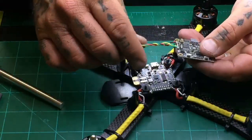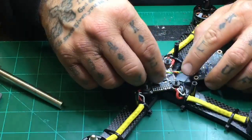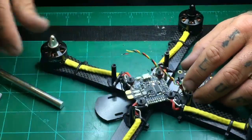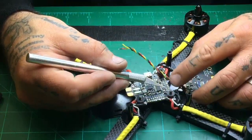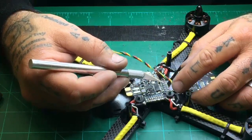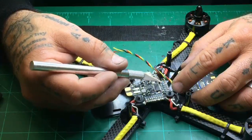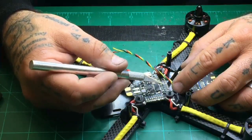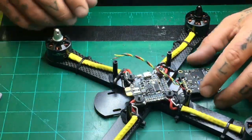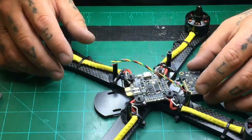Okay, so on the VTX, the idea here is to lay the board upside down and see how far we want to go with these wires. I like to keep them pretty thin, and I want them to run underneath. So the board's labeled pretty good here. It is set for 9 volt. I tested this with my voltmeter and my multimeter, and I did get higher than 9 out of these. But I'm sorry, it's up here. This is just the solder to tell the board which one. You can either just move it to 5 volt, or you keep it at 9 volt. By factory, it has 9 volt, but I got like 10 point something out of this. But in either case, that made it really good for VTX power and camera power.